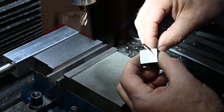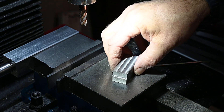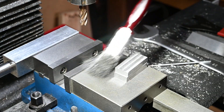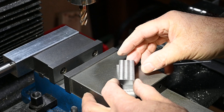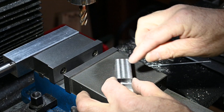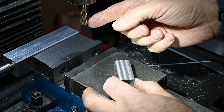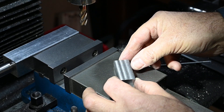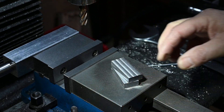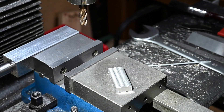I need to mark the center line so that I know where to put the V-slot. I'm going to use the cutter to put a V-slot in here - I'm going to set that up at 45 degrees. I'll just put one of them to one side for now, I don't need this one for a little while.